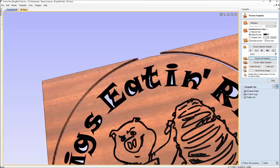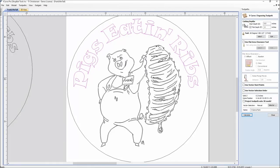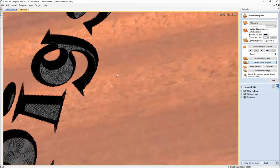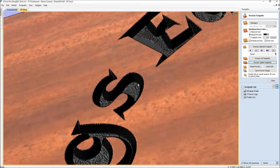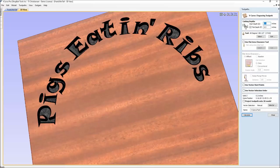When you're sign making and you still want a V edge but don't want to cut through, you create a flat depth — how deep you want to go into your material. I want it to go a half-inch deep, so I'm restricting that V-bit from going all the way through. I'm restricting it to a flat depth. Notice we haven't touched the start depth yet. I've given it a flat depth of 0.5, so if I preview that toolpath you can see the font is restricted to only a half-inch deep.